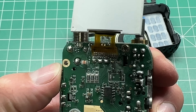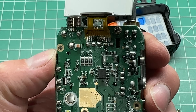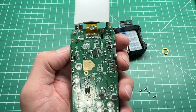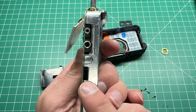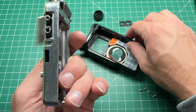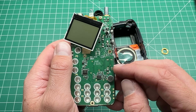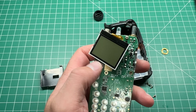More chips are exposed underneath. There's a ribbon cable at the top for the LCD, and all of this is just control board stuff. I'm going to be interested in the RF stuff, which will be on the other side. The USB-C — where was that supposed to go? It's on the other side, because you can see the cutout in the die cast. But there are no pins on this side of the board, so let's have a look on the other side.